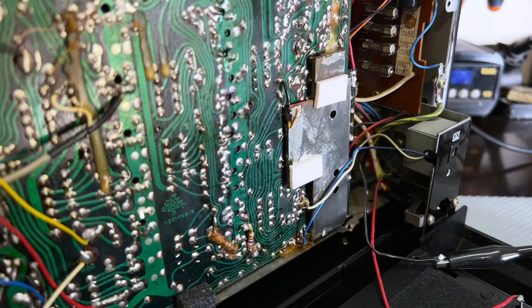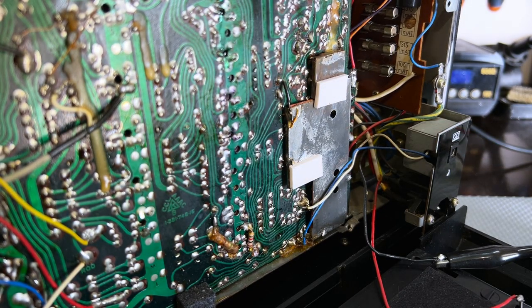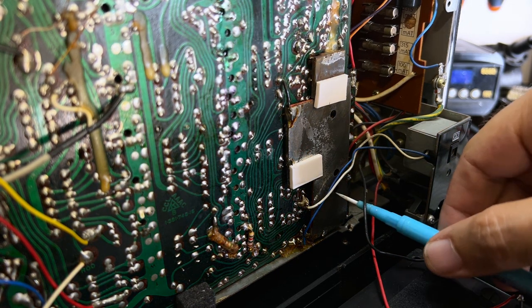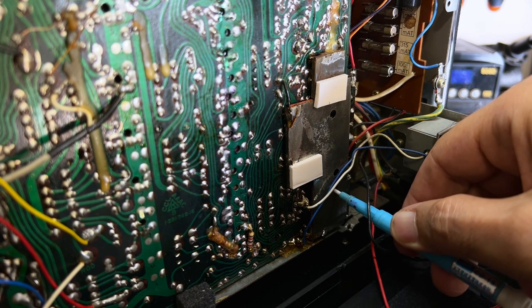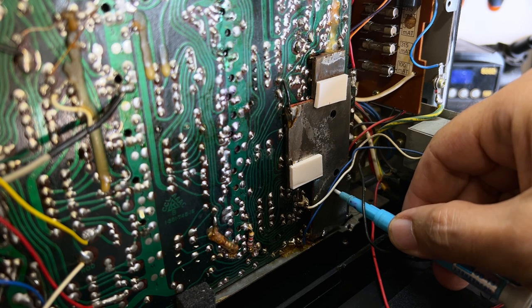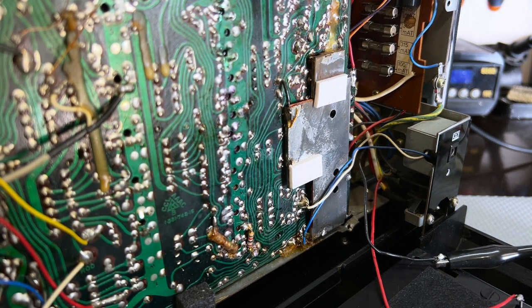Given this a tone, AM modulated, as they ask, if I go down to 10.7, I can hear a lot more, right? So let me adjust this guy. I'm doing this by ear. I can hear the tone. And now I can't hear the tone. Okay, that's done. So we go to the next step.